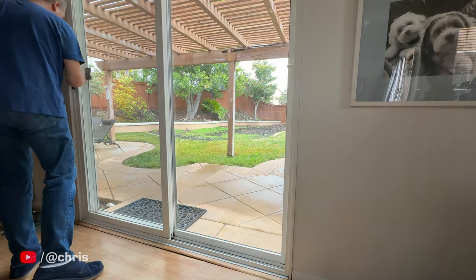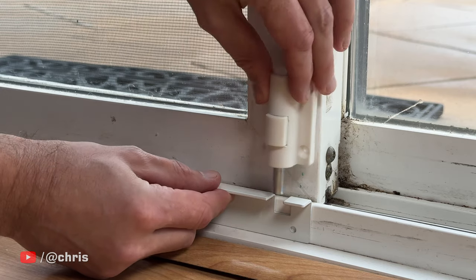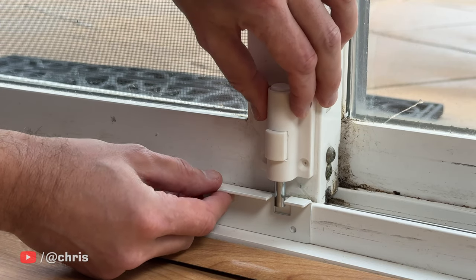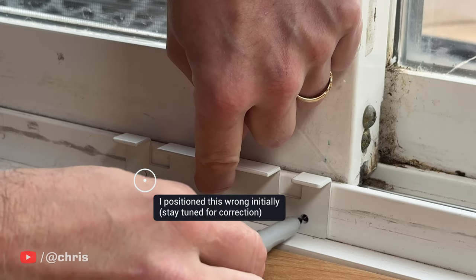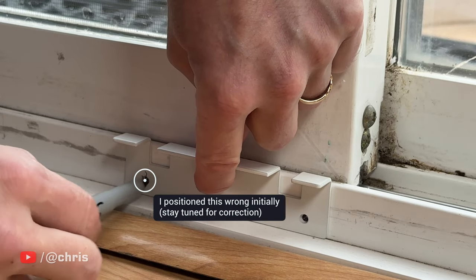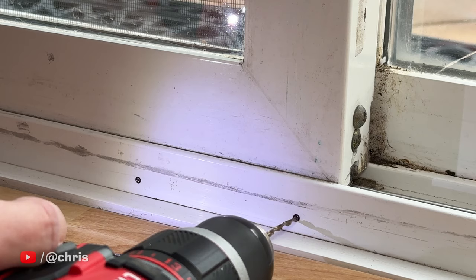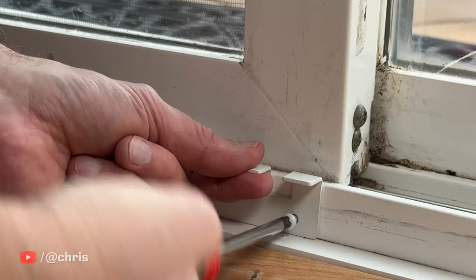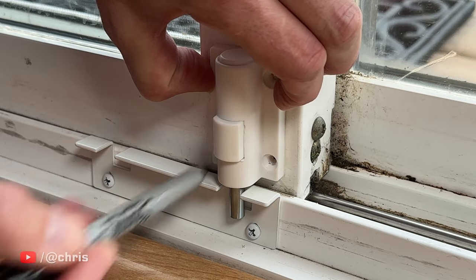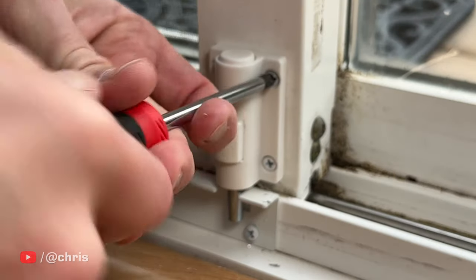Installation is pretty easy. First, you want to close the door tightly, then loosely position the notch plate on the door frame and the lock on the slider. Make sure it's going to fit before you start drilling away. Once you're sure it's going to work for you, start with the notch plate by marking the two holes with a pen. Then using a drill bit thinner than the screws, drill your pilot holes. Finally, install the two screws. Now do the same thing for the four screws for the lock after putting it into position with the lock enabled. Test it out and make any necessary adjustments.